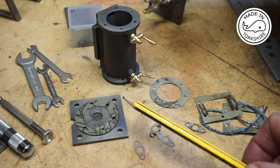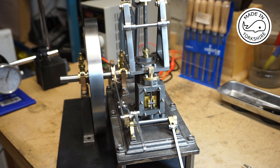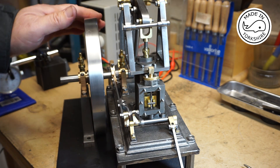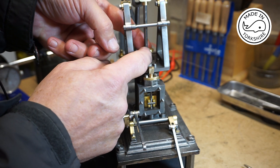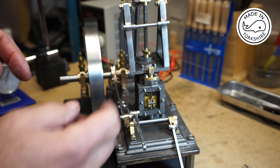So for the test assembly I've decided to use the gaskets. The assembly of this engine is quite straightforward so I'm going to do most of it off camera - it's all self explanatory. But I'll get back to you once we get to the point where I need to look at the timing. I've connected up the cylinder and the piston and the beam. I've not connected up the valve assembly and I just thought I'd try and see how it turns. It turns fine, however if I put this gland washer or bush in here, the piston rod tightens up against it. So I need to do some work on that and remachine it, but for the purpose of this test I'm going to leave that loose.